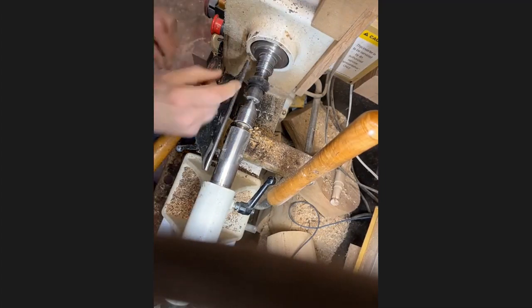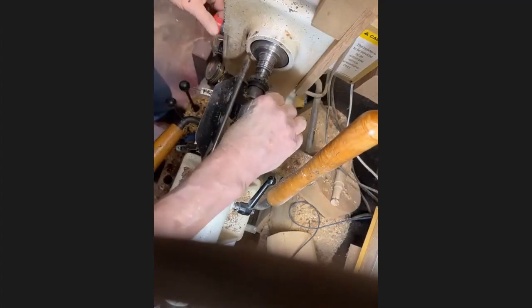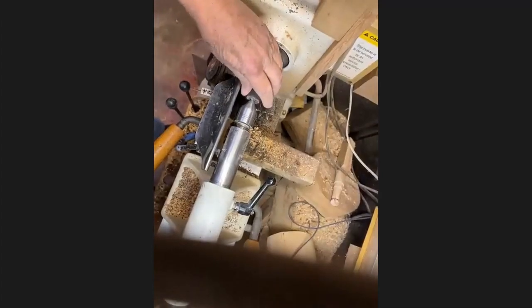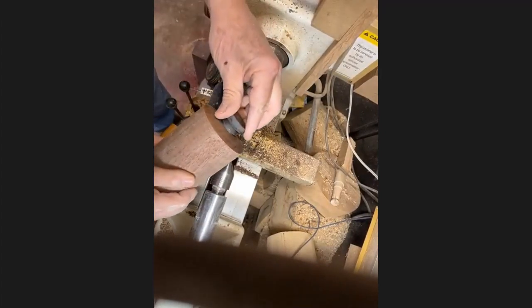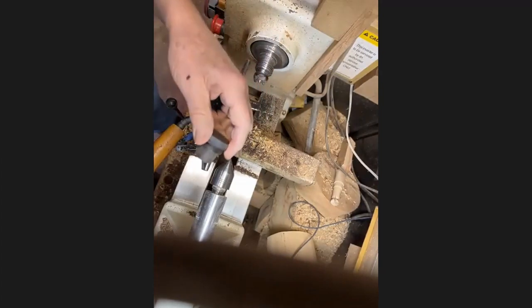And this edge now is razor sharp. There will be no tear out whatsoever. And because it is so sharp, it's like a little razor blade, right? I like to take just a little 800 right there and just touch it. Okay, so we take it off and we're going to do one final fit. Perfect. See, there's no gap all the way around and there's no wiggle, right? It's very important. Okay, so now what we can do is we can knock this spruce thing around.